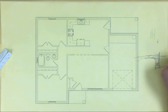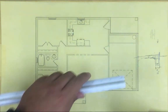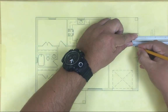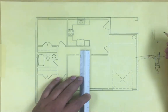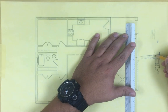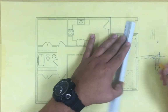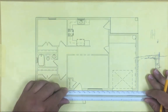The distance from here to here is 12 inches, so we're gonna come in 12 inches all the way around. We did quarter scale - I'm going to do this fast but you can take more time. We're gonna go from the edge, come in 12 inches - I'm eyeballing it, but in your case you have to measure 12 inches in. The way you're gonna draw it, you're gonna do a hidden line, because from the top you cannot see the footing, it's underneath. So you're gonna show that with a hidden line.